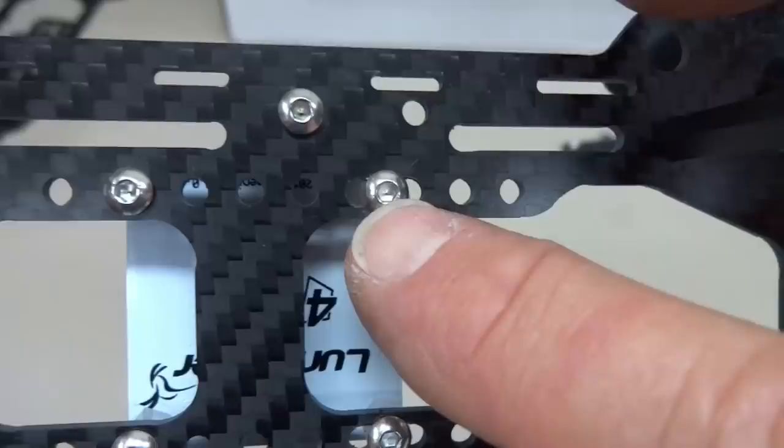All right, might look a little bit crazy, but that's because I left all the wires loose so I can show you what it is we're dealing with. Let's start here in the front. This is the plug that will go into my camera. The power comes off, you saw this power cord come off of my filter, which is located here. My filter is also providing power underneath the NAZE32 back here to my video transmitter. So I got clean power for both video transmitter and camera. So that whole video system is going to be nice and clear of any interference, hopefully.